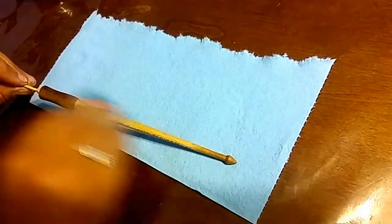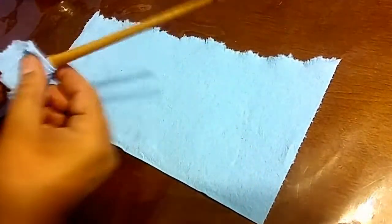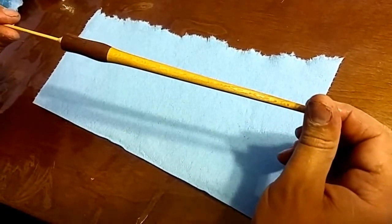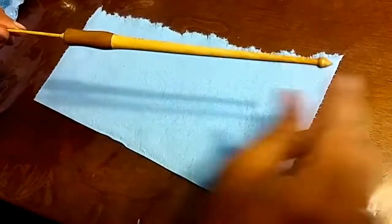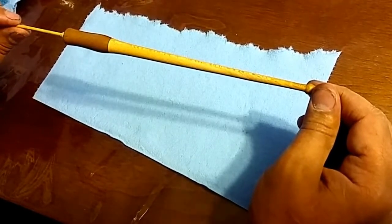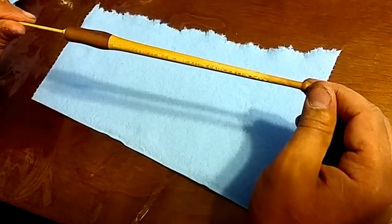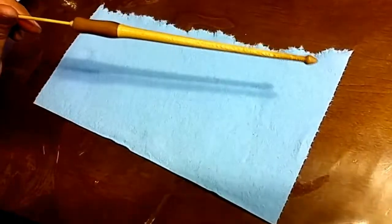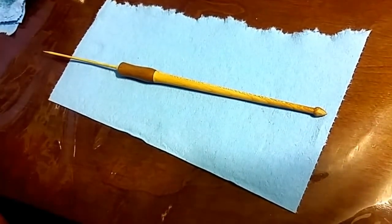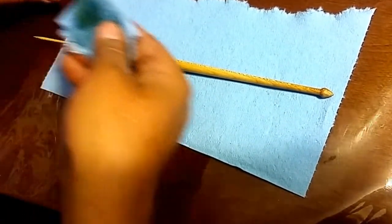Now, if you've got any scratches in the wood, this is the point at which they would become very apparent when you put that finish on. But there are none, as you can see. That sanding horizontally took care of all those. But that wood is really coming out nice. I'll keep adding layer upon layer on this till I've got quite a few, maybe 10 layers, and until the wood just seems to have soaked up most of what it will.